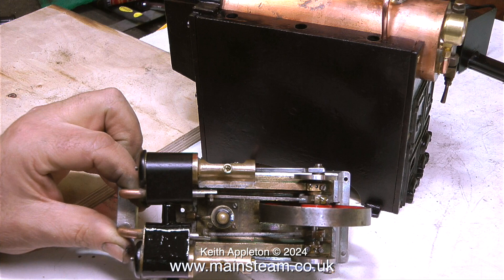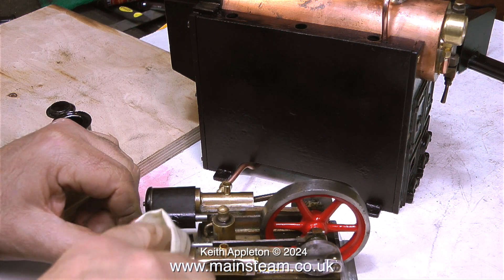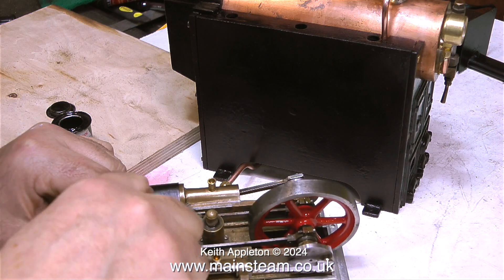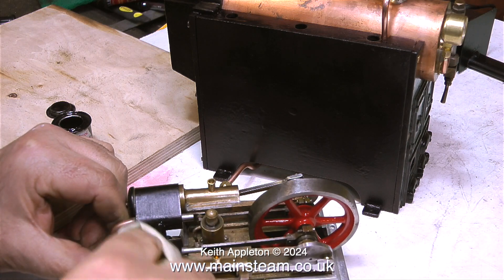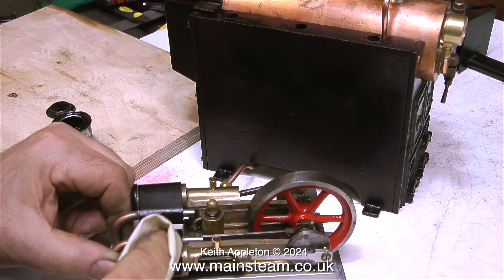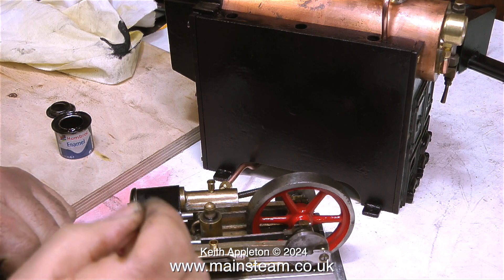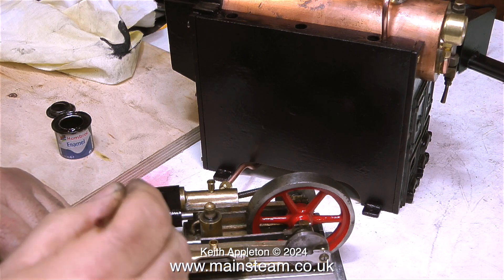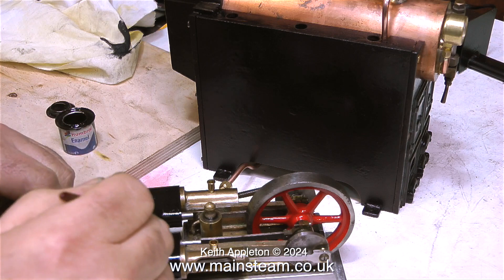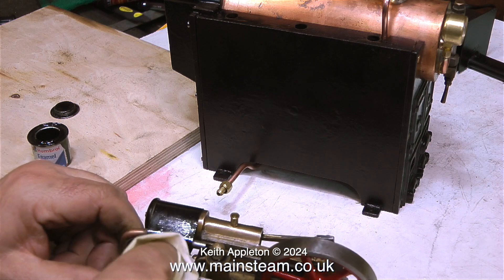To deal with the gaps between the steam cylinders and the cladding, I decided to use some Humbrol black enamel. The cladding looked horrible at first, so I wiped it off with a cloth. After a few applications of paint and wiping off, the cladding started to look okay. This cladding was very rusty before I cleaned it up, so it's never going to be a perfect smooth finish. I didn't want to keep overspraying as a thick coating of paint looks really bad when chipped.